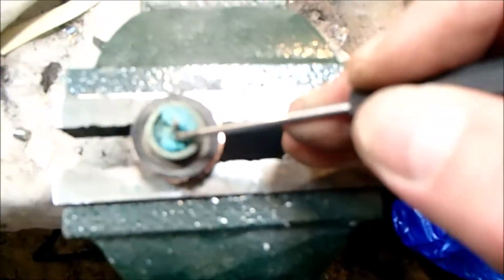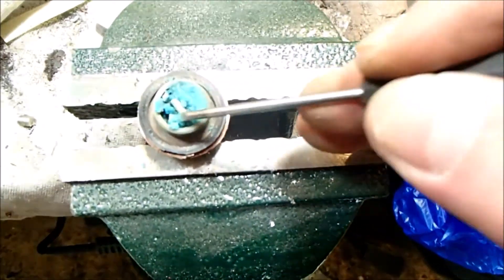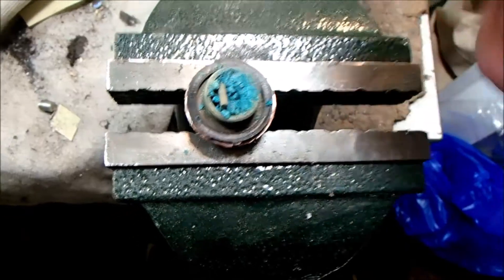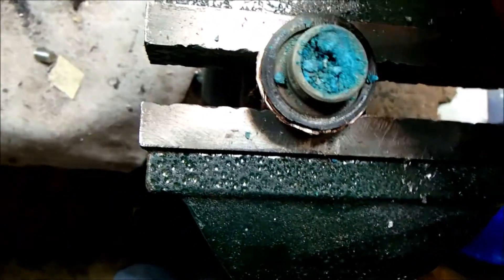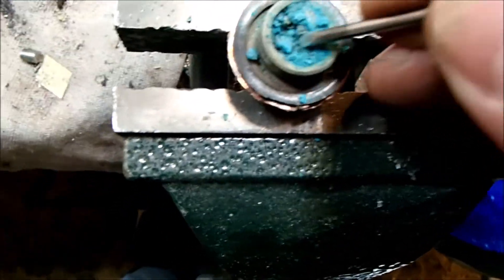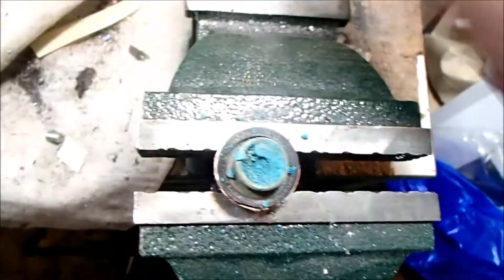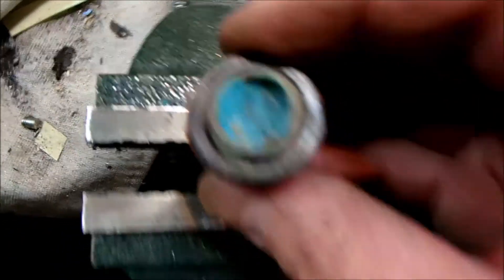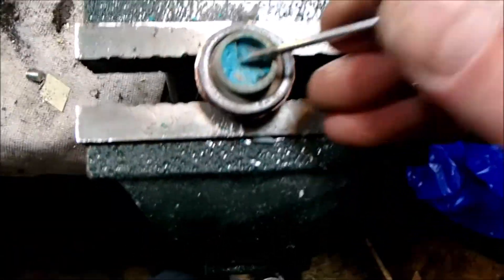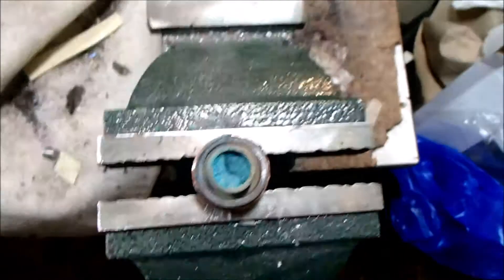So we've got all this dry material in here, which I'm not sure what it is. I mean, this could have been wax at one point — hard to say, it seems a bit dry for wax. There's one of those pins — I'm going to dig that out. And under there, there should be the switch contacts. There's one that's just disintegrated — it's just turned to mush. So all the green is the copper from the contact. I'm guessing that moisture, corrosion, coolant, or water has gotten in there. Yeah, the contact's completely gone in there. I suppose it's 30 years old.